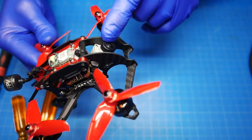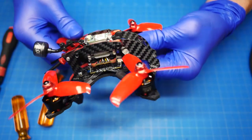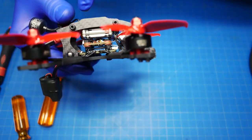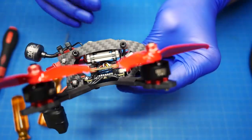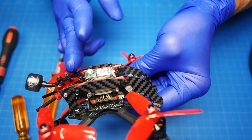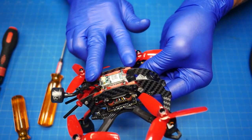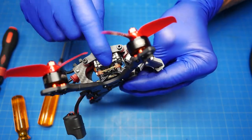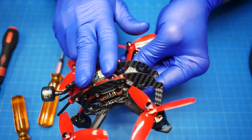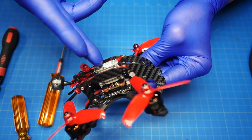You can see how the camera is mounted in here — that's pretty standard. You can get any camera angle you want. One other thing about this build regarding wiring of the Vista: the Vista has pads that you hardwire to. The way we built this up, you can take out two of the screws and rotate this entire middle section up with the Vista attached — the wires are long enough to allow that. This lets you reach the stack if you need to do repairs, replace the flight controller, or whatever. It's kind of like a clamshell that lets you into the goods on the inside.